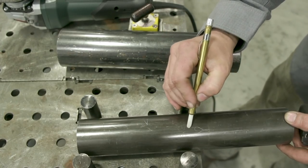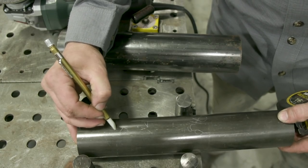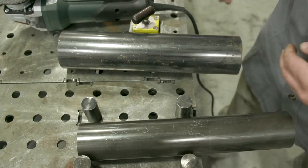This is going to be eight and five-eighths sticking out of here. Then this side is going to be four and sixteenths. So the next step is we're going to draw our line with a pipe wrap so we know this is going to line up with our pipe.